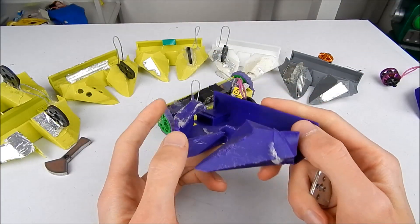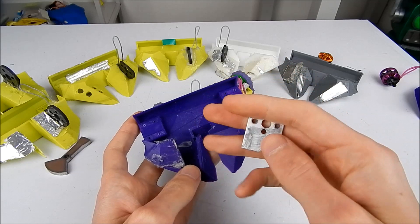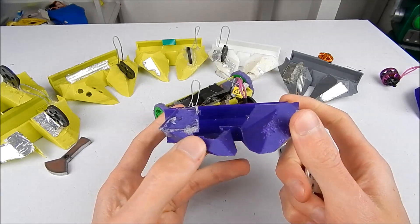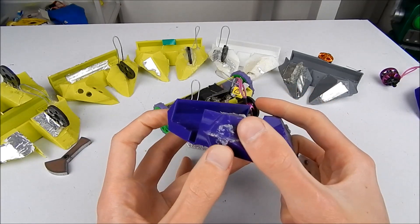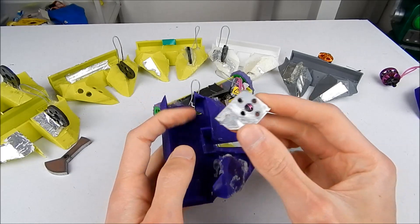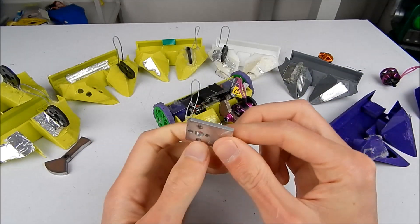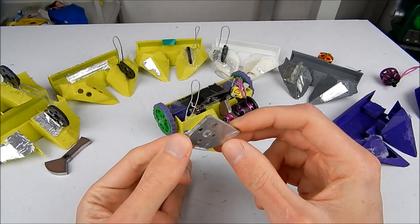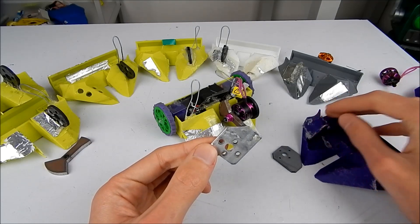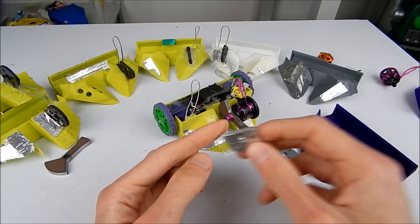This was its very first event, and being PLA plastic it was rather brittle. Being held onto the motor and dishing out and taking monster hits on just a small section of PLA, it just shattered along the layer lines and was repaired multiple times during the event. It was also really close on weight, mostly because of this aluminium chunk — it's three millimeter thick and ridiculously overkill for a motor mount, especially since it was being bonded directly into a 3D printed part where the layer lines were always going to be the weakest point. So in the next version I decided to change that.